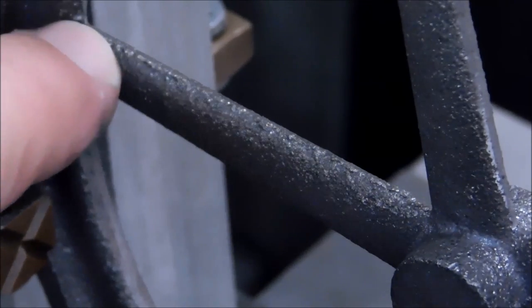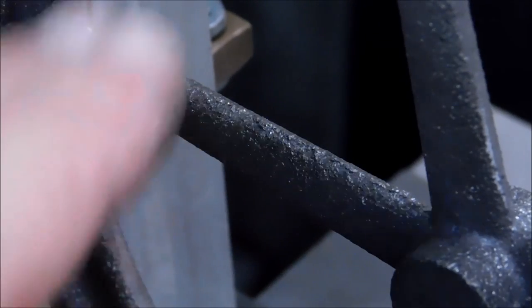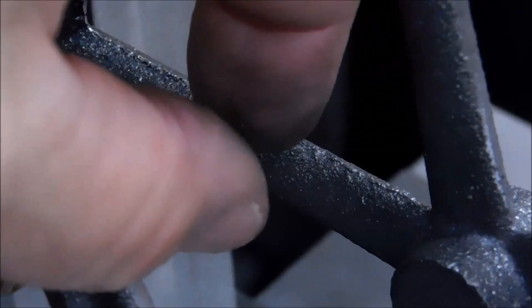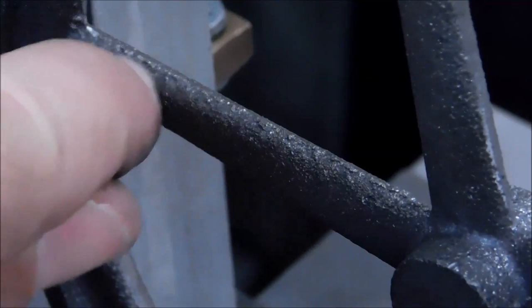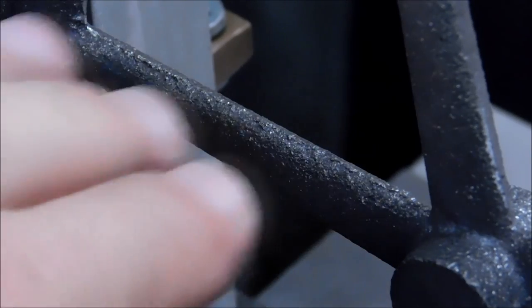I had originally promised myself that I wasn't going to film this whole operation, but I think that there's a lot of value in this particular demonstration. This parting line right here is like the surface of the moon. It's very irregular. Not only is it irregular, but it's off center to the backside. So if these were two pieces and you just slid your fingers and just separated them, one would be higher than the other. So the edge that you may be seeing here is like a wave coming over the top. On the bottom, it's like a wave going under the bottom.